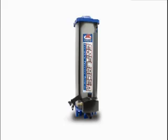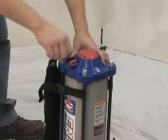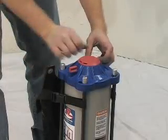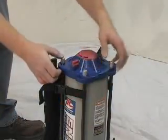Start by removing the lid and piston. To do this, you simply loosen the top 4 bolts a turn or two until they are no longer holding the lid down. It will become obvious when they are loose because they will turn freely in either direction. Once the 4 bolts have been loosened, lift up on the red top cap locking pin and turn the lid.